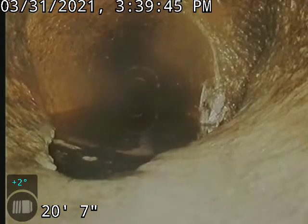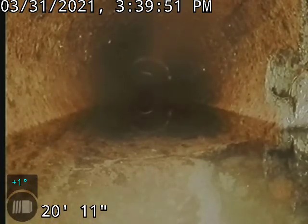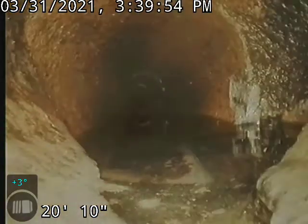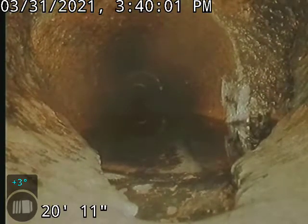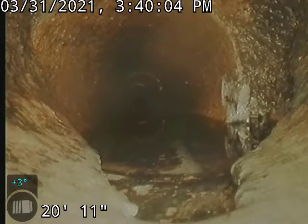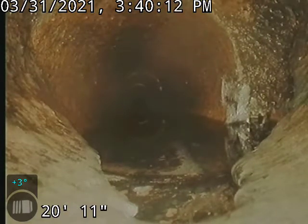All right, we're back, and as you can tell, we're much cleaner. This is our transition from clay, which does look a little bit hammered on the right side there due to the roots coming in. It does look like our cast iron is losing a little bit of piping right there as well. But besides that, I don't think that's going to be an issue. As long as we keep this root cleared out of this line, everything should flow perfectly.